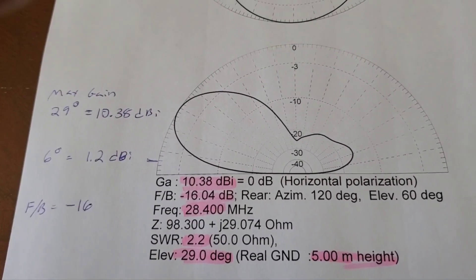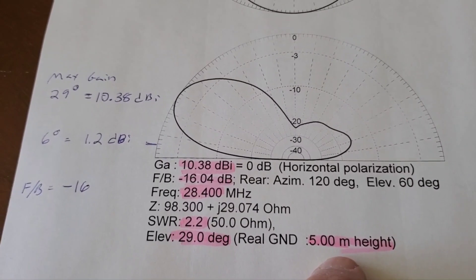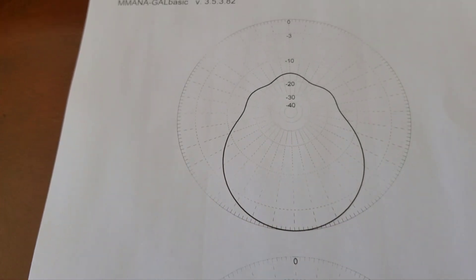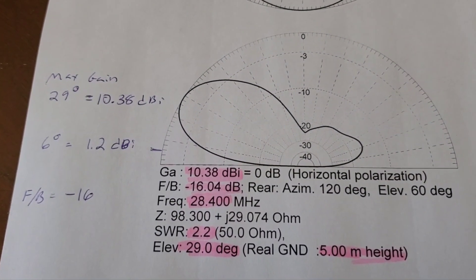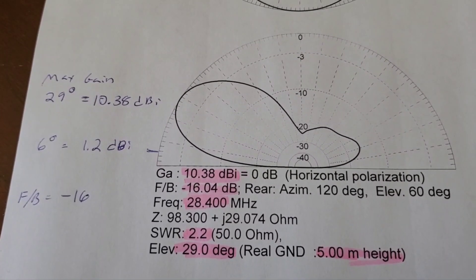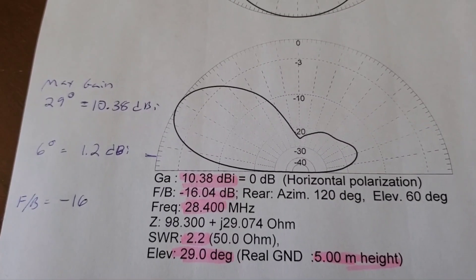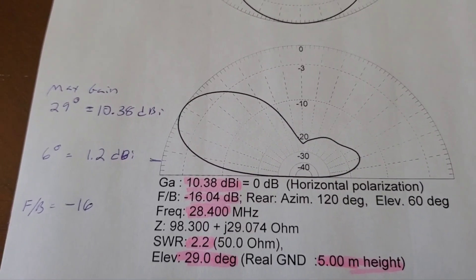This radiation pattern is with the antenna at five meters - a half wavelength above the ground - where you'll see the best performance. This has been a very successful build and it's worth making a permanent setup now that I know it works well. It's portable enough to throw in the back of a truck, and the footprint with the spider beam is very small.